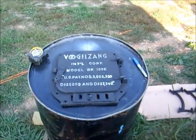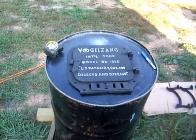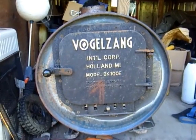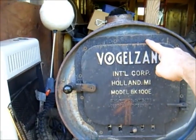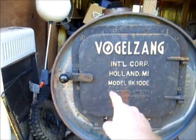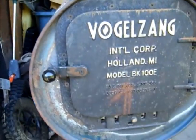One note: try to make sure the door is somewhat towards the bottom instead of the top. Last year we put one at the top and the smoke just rolled out whenever you opened the door. On last year's stove I put it all the way to the top to try to leave room for firewood at the bottom — that's fine, but as you open the door it would just release smoke. So try to keep it towards the bottom as best as possible.